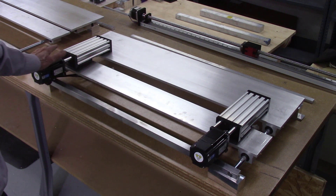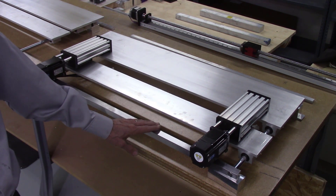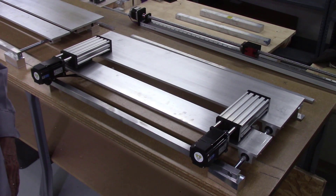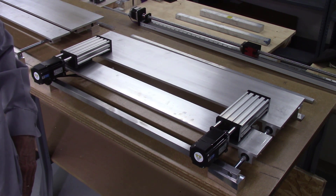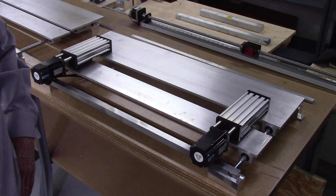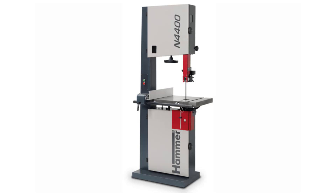These two indexers will need to be moved or indexed at the same rate and time to ensure accurate movement of the boards being sliced. We hope to be able to slice boards at least 50 inches long and hopefully even longer with these new systems. I'll be designing a number of miter bars for use with these systems. This first unit will initially have a miter bar which is three-quarter inches wide to fit the Laguna bandsaws and other standard American-type bandsaws. However, I also have a Hammer Model 4400 bandsaw on order, so I plan on making a miter bar to adapt the 36-inch version to that bandsaw, which requires a different 15mm-wide miter bar.